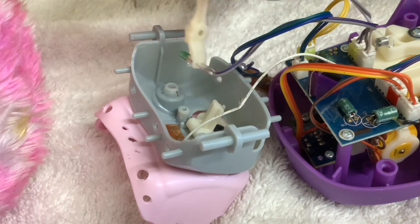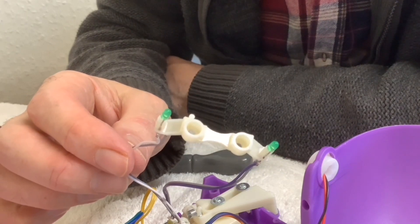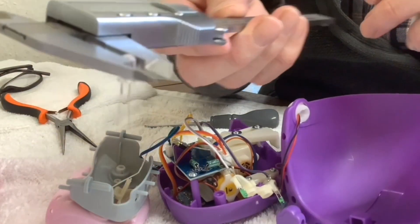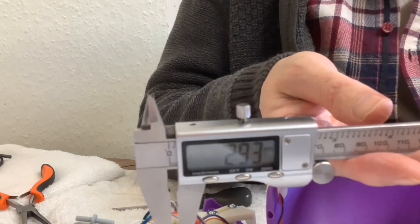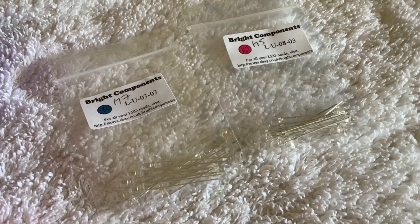That slides off and the LEDs come out. I can see straight away that they are small LEDs and we don't have any of those — we've got the large type, which are considerably larger. These are called five millimeter LEDs because they go into a five millimeter hole, but this green one measures 2.93 millimeters, so it goes into a three millimeter hole. We need three millimeter LEDs, which Paul has ordered and they've arrived.